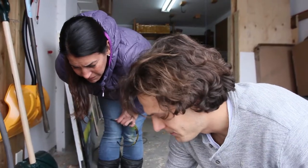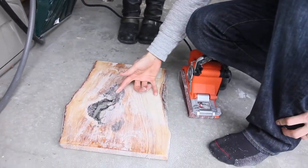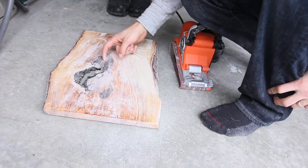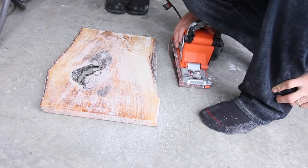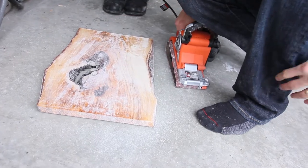With this process, when you have dense stuff in wood, it's a bit like — you pour, then you sand, and then that reveals low spots. Then you pour again. To make it perfect, you might even do this two more times — maybe even three more times.